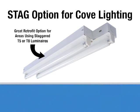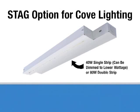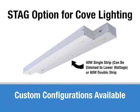Cove lighting is a very large potential application for this product. There are a lot of coves in existence and LED retrofits for them have been hard to come by. We can make a cover for a stagger strip and use either one single 40-watt lamp or two 80-watt configurations. We can also, in the 40-watt application, put a dimmer on the ballast so that it can be brought down to a lower light level. Because of the distribution of the light out of the LED, it distributes light better off the ends than a fluorescent tube. So even with a single strip configuration, the shadows in between the fixtures are minimized.